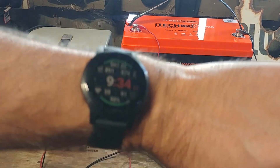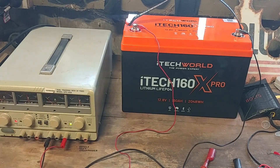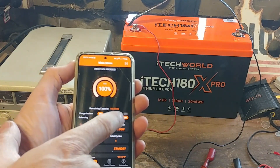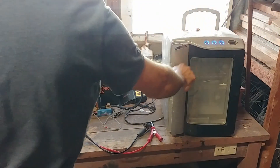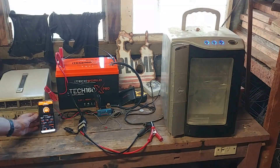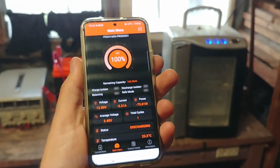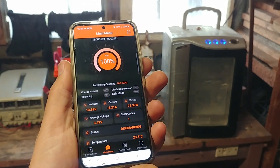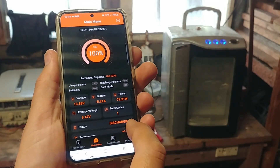It's the morning of Saturday the 22nd of February. Battery 2031 has been on charge overnight with the power supply, and the iTech World app shows it's fully charged with safe mode and the charge isolator activated to prevent overcharge. So we know this battery is as full as it can get — let's start the discharge test. That's running flat out now. The iTech World app shows we're drawing about 5.5 amps, 73 watts, which is about what we'd expect. We've dropped out of safe mode, which happens pretty much as soon as the charge is disconnected.